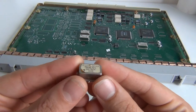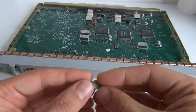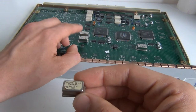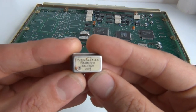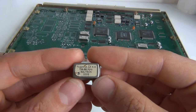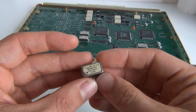One didn't work. I took it out and I want to see what's inside, and after that I can show you that you can use it as a transmitter. I take one out of the board, put some voltage on it, and I can show you on my computer with some SDR software. This one should be about 38.8 megahertz, but I couldn't measure it, so I think it's broken. Let's take the Dremel and open it and see what's inside.